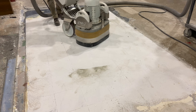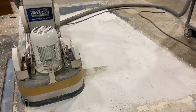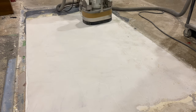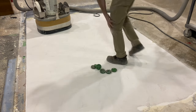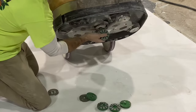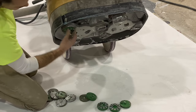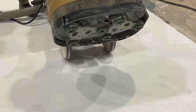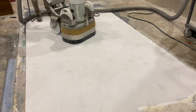This part of the process is faster because its only goal is to remove whatever residual is still there and to smooth the floor out. At this point the canvas — the floor — is pretty open and clean; now it's just a matter of refinement. Next is the 70 grit, done to refine the surface further because the coating going on is only between 10 and 12 total mils dry film thickness. Scratches from the 30 grit would likely telegraph through the coating if left as-is, so the 70 grit helps minimize the chances of that.